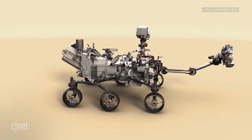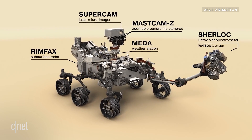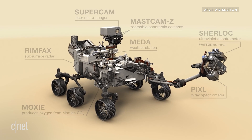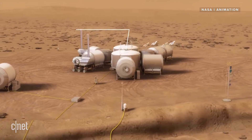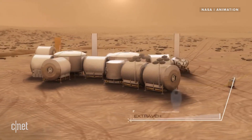This separation process requires a lot of energy and temperatures of 800 degrees Celsius, or 1,500 degrees Fahrenheit. The Perseverance rover only has 110 watts of power to share across all of its instruments, which is why in this first trial run MOXIE only created about five grams of oxygen. In kind of normal activity, we might use 20 or 30 grams of oxygen — so another way to say that is, keep us alive and happy and active for 10 minutes. That's what we make in one day's operation. So we have a long way to go from keeping one person alive for 10 minutes to providing all the oxygen for a human base and an ascent rocket. But this is the first one small breath for a human — one giant leap for humankind.